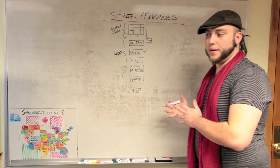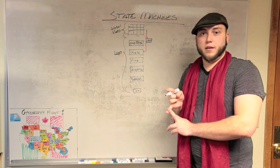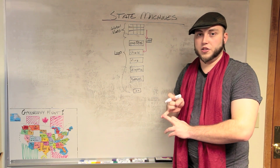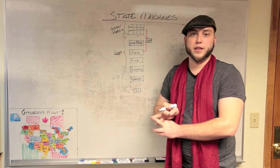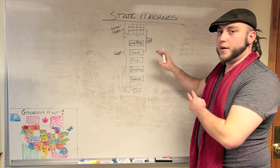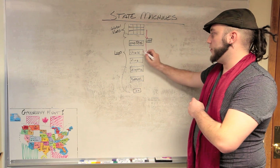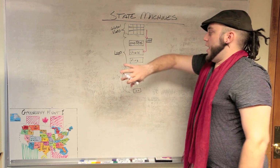And all the shield update module does is it controls the animation of the shield, which is basically just which LEDs are lit, and it controls the level that the shield is at. So it has a series of its own timers. All it does is update. Keep in mind that when it goes to the shield module, it doesn't stay there very long. It just updates it once and gets out of there.